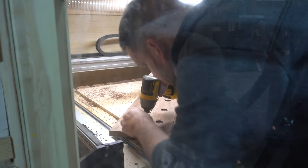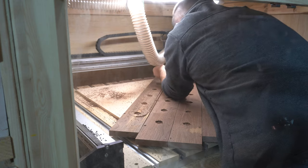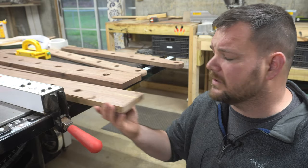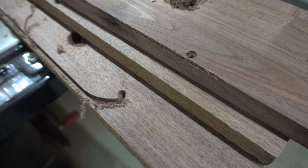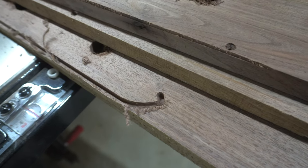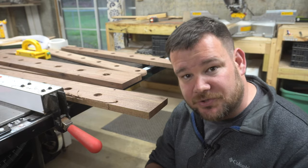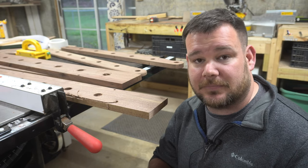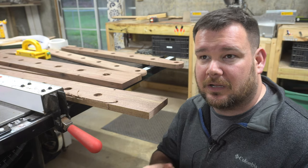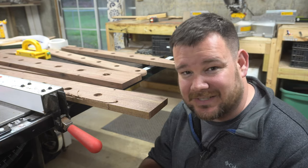The problem I've been running into is lining them up on the CNC bed so that the shape I'm cutting fits the stock I have. The CNC reaches the end of its 33 inches and just limits out. So I'm going to try running two parts at a time instead of all four — there's just not enough room for error running all four at once.